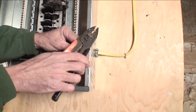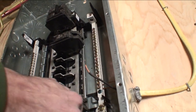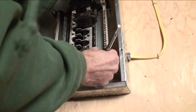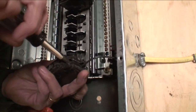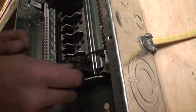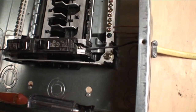I've got the strippers here, stripping back a half inch. What I like to do is take the breaker out, insert the wire where I can see it — because it's hard to see when it's inside there — and tighten it like this. I can feel that, and then I can adjust this accordingly. Nice straight line, and that breaker's all hooked up.